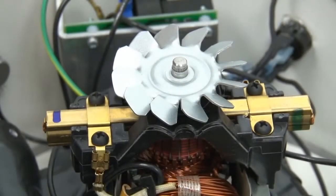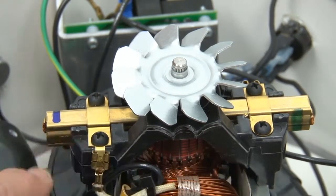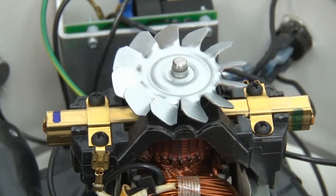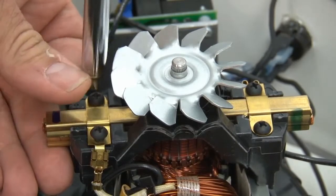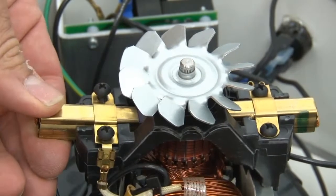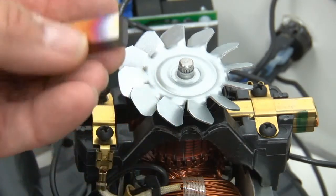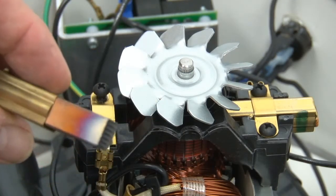Here's how we change the brushes — it's very simple. You do not have any wires to disconnect with this brush. The wire is attached to this brass, holding it down, and then it transmits the voltage to the brush. To change the brushes, all you're going to do is loosen these screws — you don't need to take them all the way out — and then pop up on that little brass clip. It comes right out. Notice how long that graphite is on this brush. You can also see this one has already been broken in — the motor manufacturer does that.